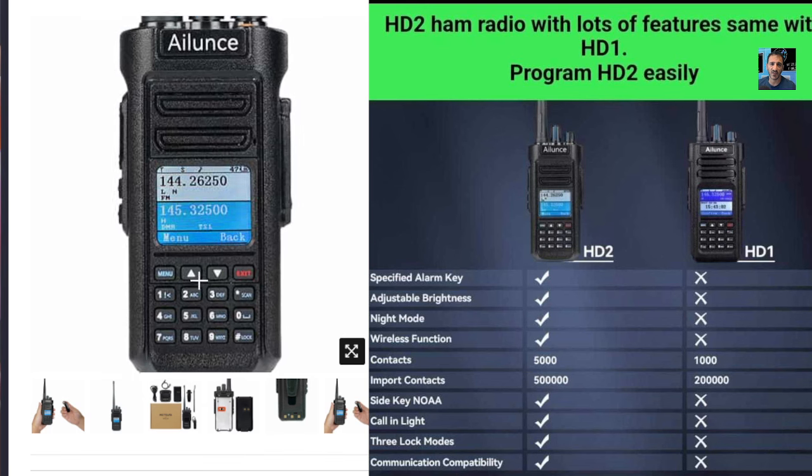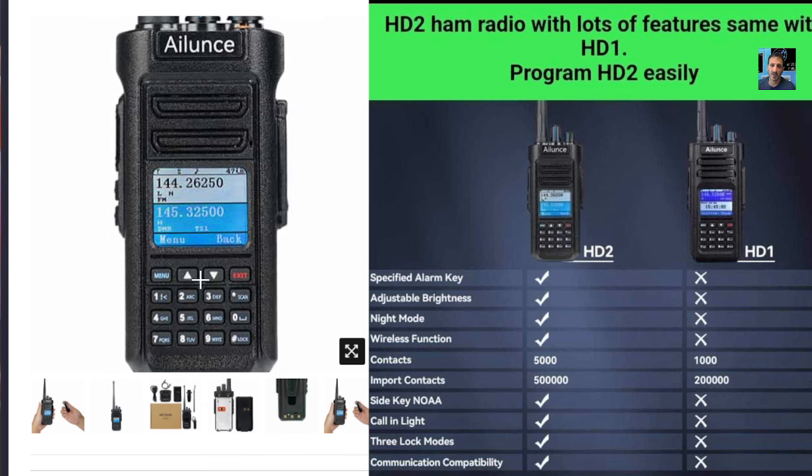And quite straightforward. Don't forget, DMR is a big learning curve. As soon as you start learning and using what we call code plugs, or the programming software on the computer to program the radio, there's a lot to learn. You've got your frequencies, color codes, time slot one, time slot two, and so on, and it all can get very confusing. And along with that, if you get yourself a hotspot so you can shortcut onto different talk groups, then there's more to learn.